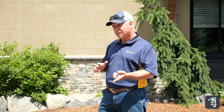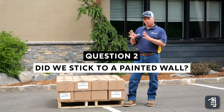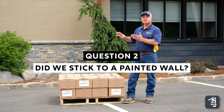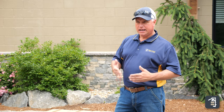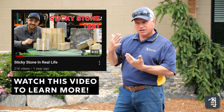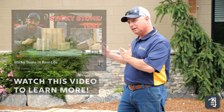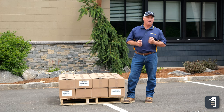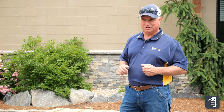The number two question we get asked often is: was the In Stone product with Sticky Stone stuck to this painted wall behind me? This is a CMU block and yes, it is painted. The answer is that Sticky Stone is only as good as your substrate behind it — so if that substrate is going to deteriorate or degrade over time, keep that in mind. With this particular application we took a wire brush, scraped the paint, and got it down to what was solid, so when we stuck the stone to it we had great performance.